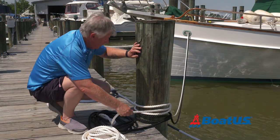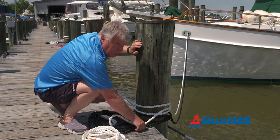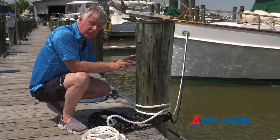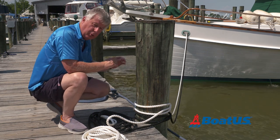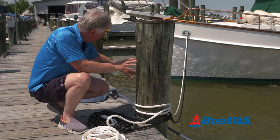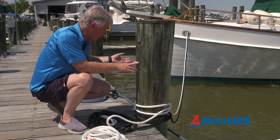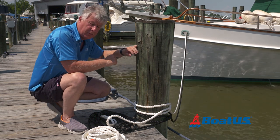I've just finished tying off the boat. We've got two lines — the different colours are actually both the same type. The reason for that is if one chafes through we'll have a backup so the boat isn't free. You'll also notice that they're quite slack, and that's to allow for the storm surge — so as the boat rises up it's not going to go drum-tight and break something.